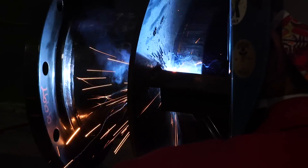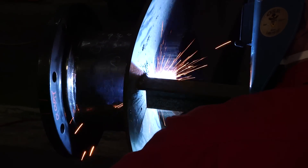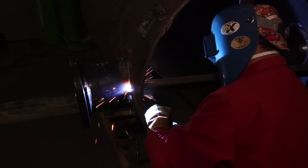Just like I said before, we install the caps, and before we weld the outside of the nozzles you have to weld the inside of the nozzles first. Right here he's putting in the root with MIG — he was likely running around 18 volts and probably around 220 wire speed.